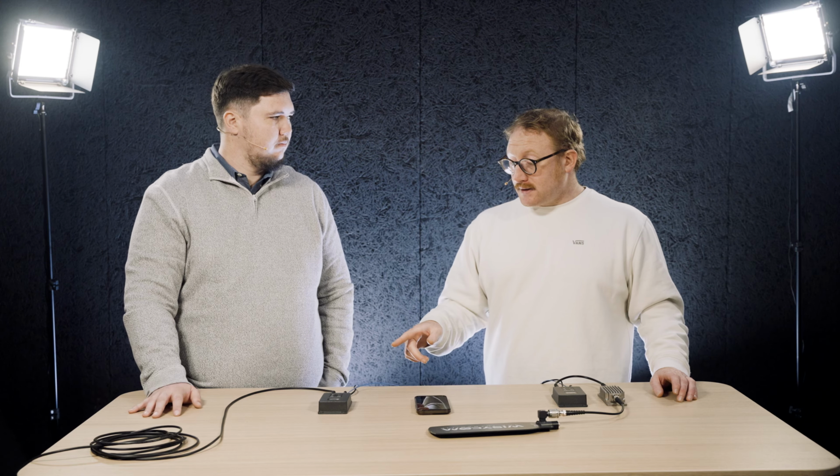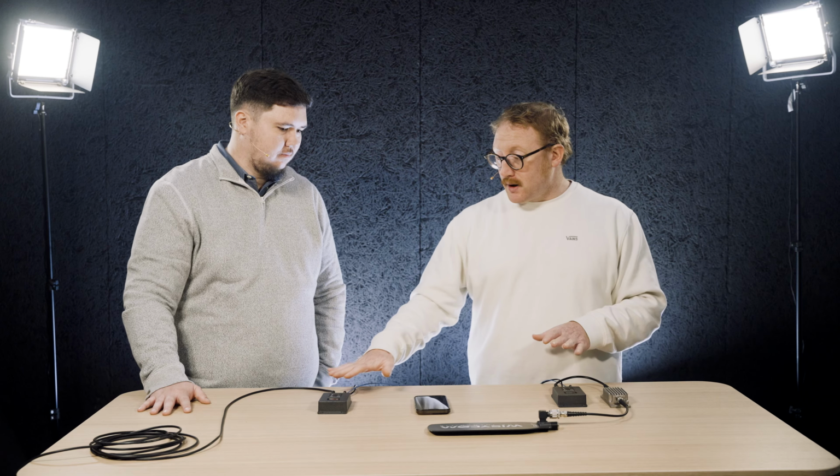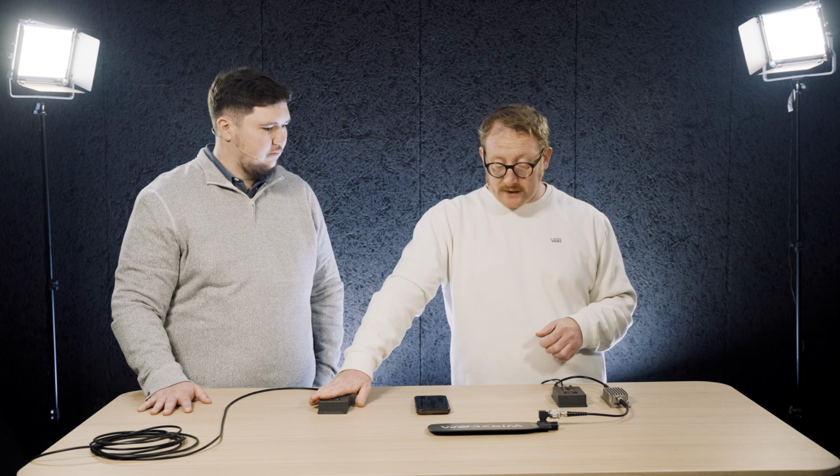When you work on the other side with IEM, IFB, of course, these rules are a bit different, because you cannot simply combine 16 or 20 carriers into one cable, one combiner, then send it over fiber, use a tiny amplifier like this, and pretend to have 20 dBm or 100, 200 milliwatts per carrier with no intermod. That's not how RF works, unfortunately. That would be nice. But there are ways of doing this, and we might have other videos in future where we explain how to handle these more complex situations. The important thing is to keep your power low when you enter the local BFL-T, and then use remote amplifiers to lift up your signals.